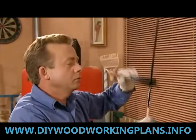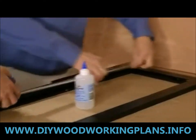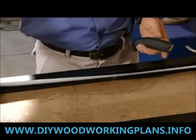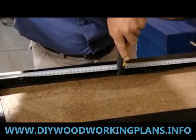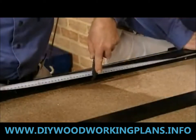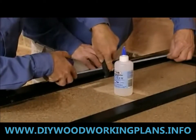Also pre-stain the six millimetre Tasmanian oak beading. We then measure and mark the position of the cross pieces, which will support our cane blind in the front and back of the screen panel. We score small notches with a trimming knife to allow our craft wood glue a firm bond with the timber frames.